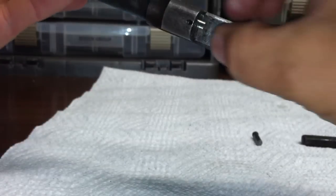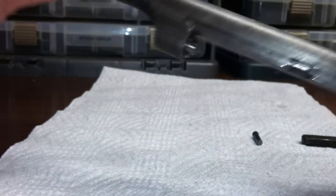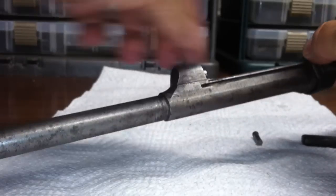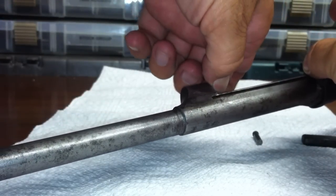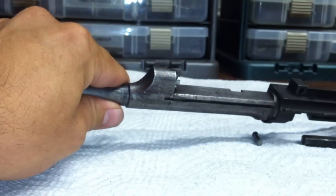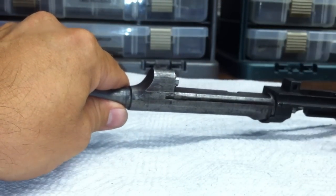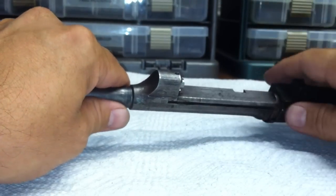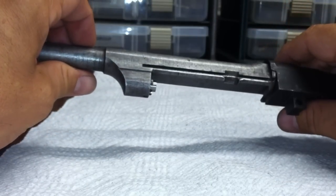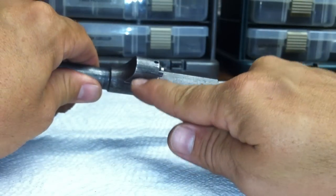It's a little tight in there now but you should be able to blow down the tube and make the piston move. After installation, the bolt and piston should move without any problems. The reason you use the tap is to clean those threads out a little better, and in the chamber area where the piston sits there should be just a little bit of up-and-down slop — very minor.